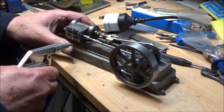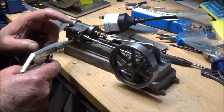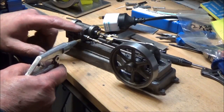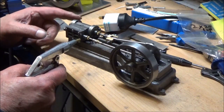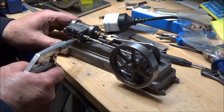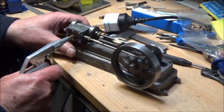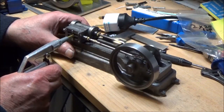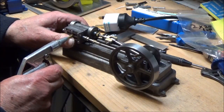I had set the valves, but I've got no gaskets on the steam box, steam chest, valve box. There's no gland packing in any of the glands. The cylinder caps are just held on with two screws each — and it amazed me, because I put a bit of air on it and it runs. And it shows every sign of being able to run slowly, which is what I want.